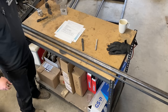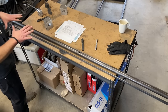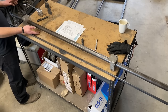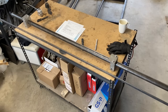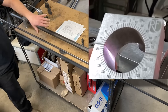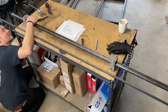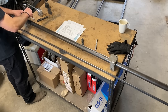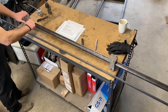This is where our bend blocks come into action. This is the first bend, this is the second bend — I'm going to bend these in opposite order. We have our clamp blocks on. Now this line needs to be oriented to the outside radius, so we've got to twist this. By the time you see this video, Rogue Fab may have come out with indexing clamp blocks where you can just line up that line with an index on the clamp block. I love Rogue Fab so much — they've done so much for garage builders. Once you have this in position, I verified the line is on the outside radius and the alignment mark is right at the clamp block.